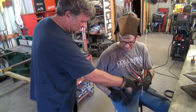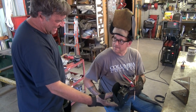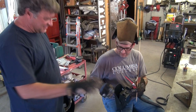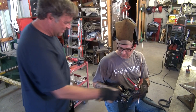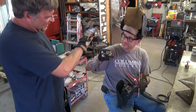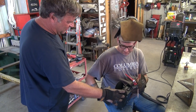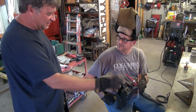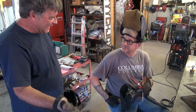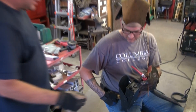Now it's just like in the car. With this all the way up, you've got max amperage, so pedal all the way down — throttle's all the way open — now you get the max heat out of it. You can sit there and control it just like the car. It totally bypasses the machine; now all the control is out here. So if you're going to work thicker metal, turn that puppy all the way up. If you're going to work some 20-gauge, go ahead and turn it way, way down, almost to the very bottom.